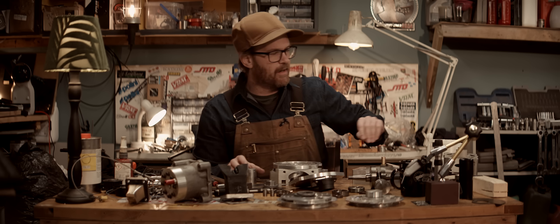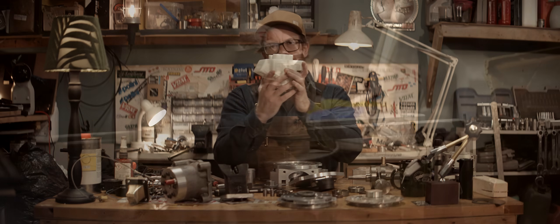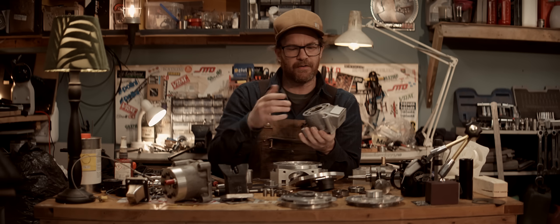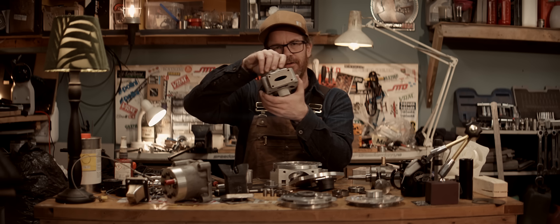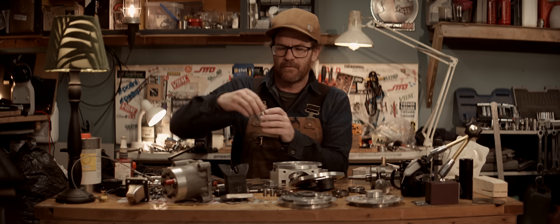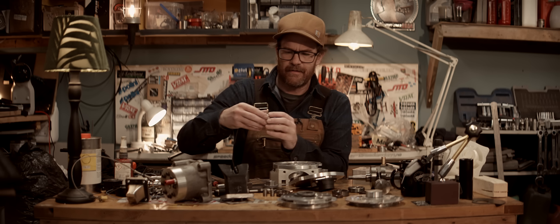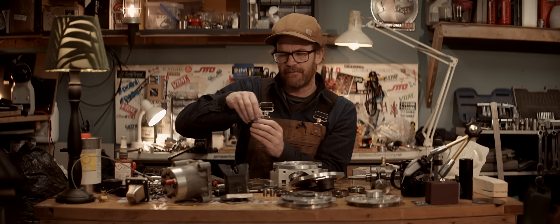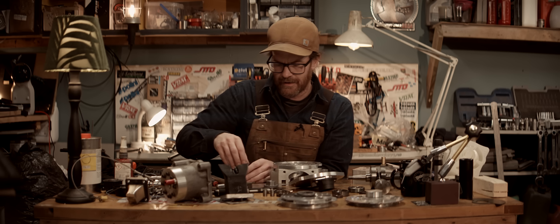You kind of get blind. The castings were made by 3D printing cylinders in PLA and then engulfing them in plaster, burning out the PLA, and then pouring the aluminium - there are videos. At that point the cylinder had a 100% of bore unbridged exhaust port. This one has that unbridged exhaust port and was meant to be run with these special pistons with a captive piston ring. There's a hole there, a pin sitting in that hole, letting the ring expand just enough but not enough to snag in the port. That's the theory.